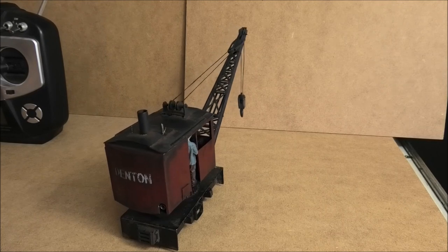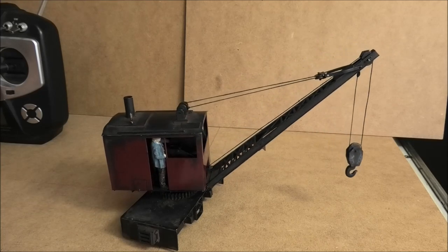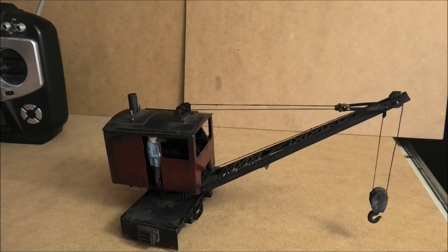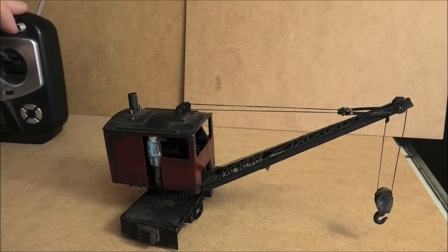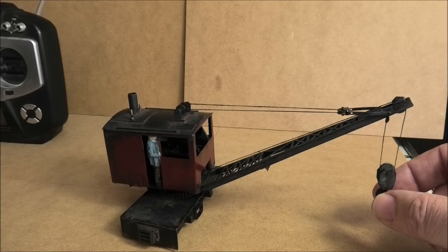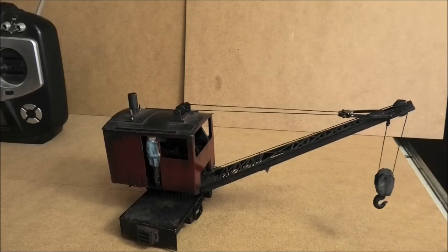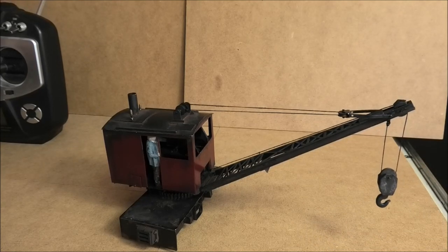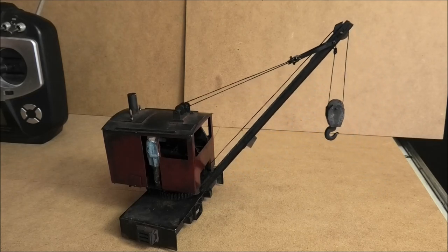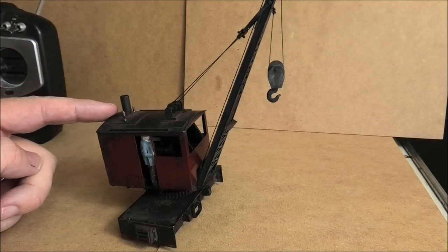This means that it's potentially very unstable when slewed to 90 degrees, and the whole thing is balanced on the knife edge of 14mm track while trying to pick something up at least 100mm away. When complete, it was necessary to weight the chassis down with lead at both ends to provide as much inherent stability as possible. And then I had to weight and balance the crane so that when at 90 degrees and the jib lifted high but unloaded, the crane was almost tipping over backwards, but not quite.